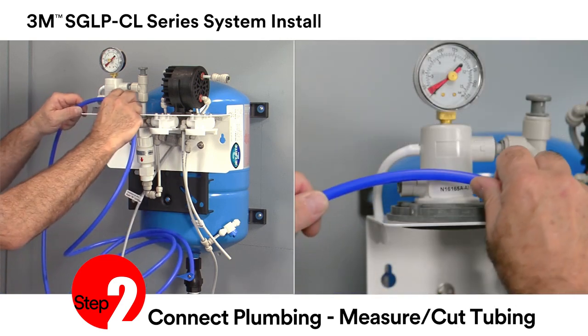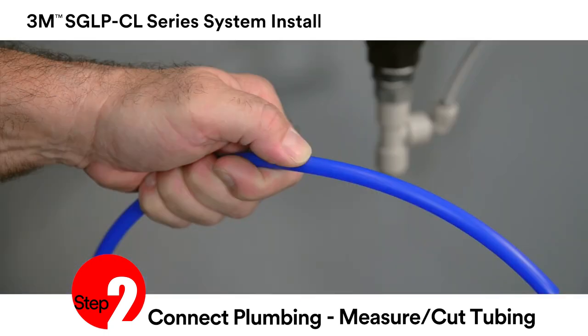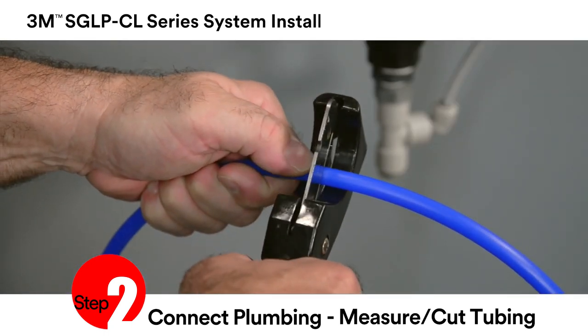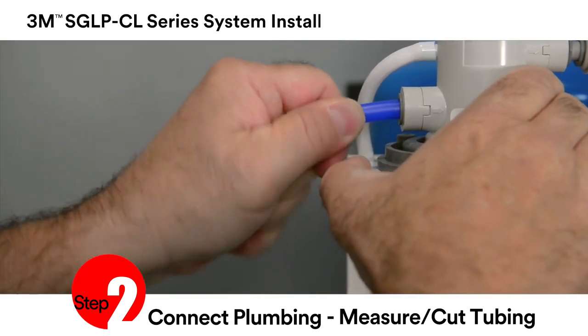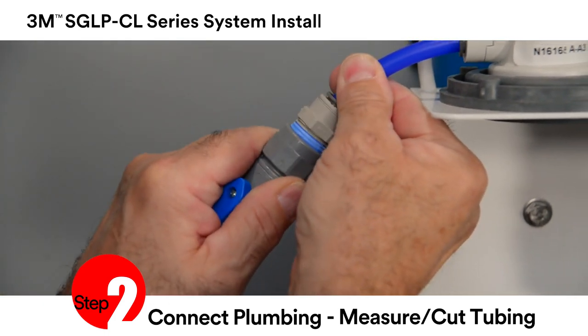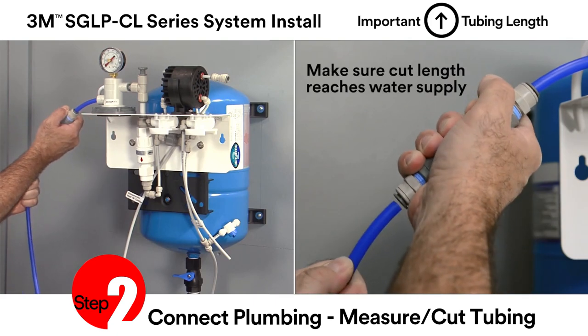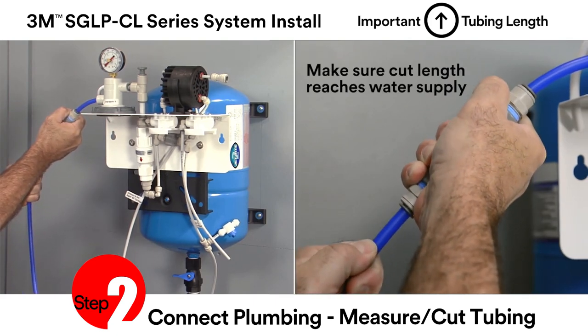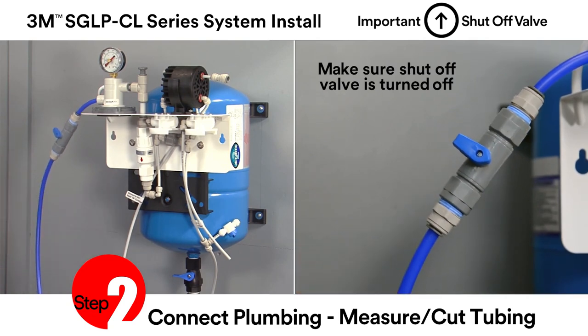Cut a 6-inch length of 3/8-inch tubing and insert it into the inlet heading on the pre-filter head. Install a 3/8-inch quick connect shutoff valve to the other end of the 6-inch length of tubing. Cut another piece of 3/8-inch tubing, then push one end of the tube into the other end of the shutoff valve. Make sure the shutoff valve is in the off position.